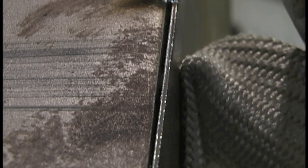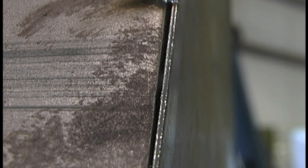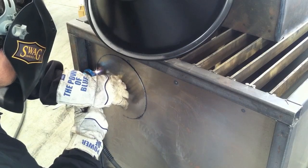Probably this really didn't even need any filler metal. It could have finished up a lot quicker and probably looked a little tighter and nicer by just fusing it together. That wouldn't make for a very interesting instructional video though, so I decided to show you one with filler. Also, if you've got little gaps, the tip is you can't step out very far before you add filler metal on a gap. You've got to add rod often and don't move the torch much in between rod additions — that's probably the most important thing.